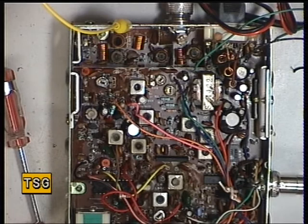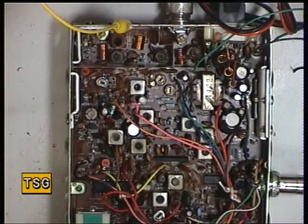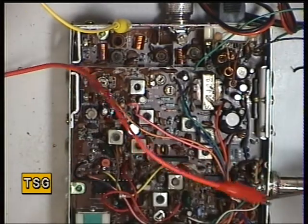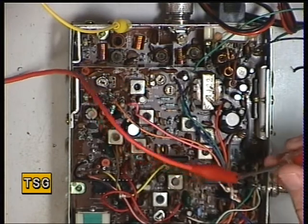To do that we're going to have to put a marker oscillator on. Ideally you'd do this on 10.695 megs using a secondary signal generator, but I have a marker oscillator here which is 455, which is fine doing it another way. So we've got the exact frequency on the test set, we've got 455 on the marker oscillator, and if I put this wire with a screwdriver somewhere in the vicinity of the 455 IF, I should get a beat note.